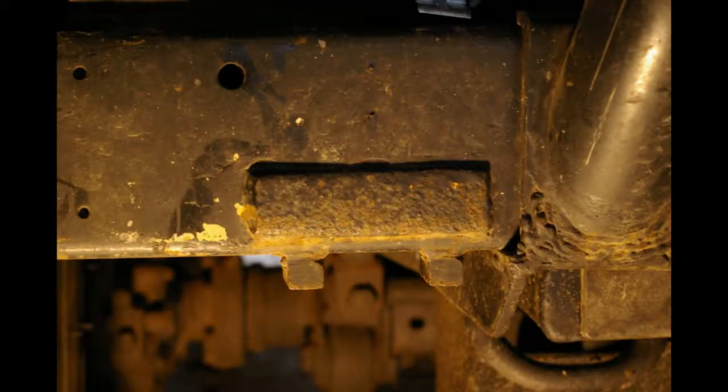We've all got them and they are very useful, in particular for the recovery situation, but they are inherently unstable and they will try to slip out, and the vehicle is likely to fall causing serious injury. A couple of tips about how to make it safer: one of the things I've done is at the front and the rear I welded lugs on underneath the bumper, so you put the shoe of the jack between the lugs and it can't slip away.